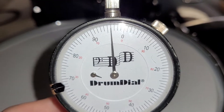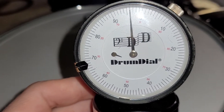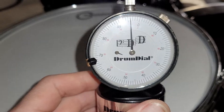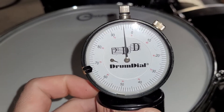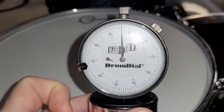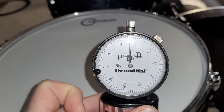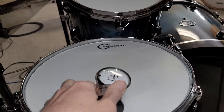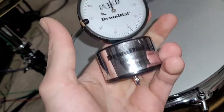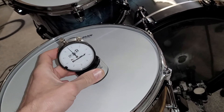You can see that instead of being at zero, it's now almost four PSI off just from one drop. So I've gotten used to knowing my zero is actually four clicks beyond what the zero shows. The gauge itself has shifted to the right and the zero is now to the right instead of right at 12 o'clock. Do not drop these — they're sensitive and this whole bottom part probably weighs five pounds, so if it drops right on the needle, that's going to affect it.